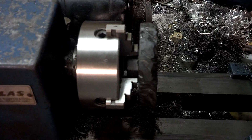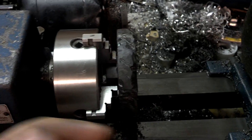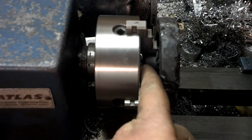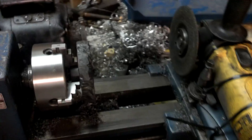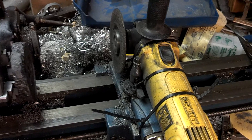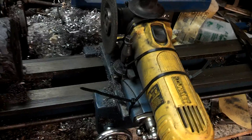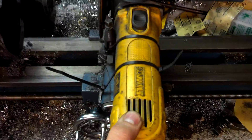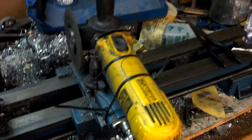So what I've done is I've chucked the piece up in the lathe that I need to be perpendicular to this face, and put a spacer in here — I took it out after I had the work clamp down. And what I did was I zip-tied this angle grinder onto the cross-feed. I've got several zip-ties on there and it doesn't move at all — it can't go back, it can't go forward, it can't go side to side.